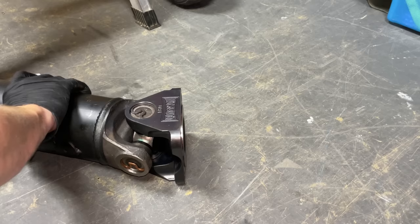We've got the rear steer handle that goes here. So the front steering on a monster truck is a normal steering wheel, just like on a normal car. Rear steer, there's a little switch that goes into here, and that's the left and right for the rear wheels. So I've got a couple of these clamps on here. We're going to put a tube on there and then weld that onto there.